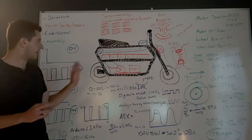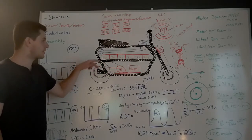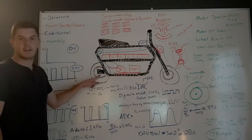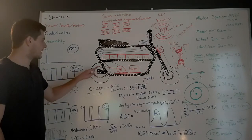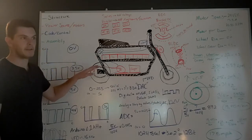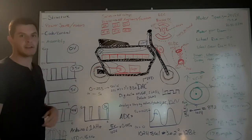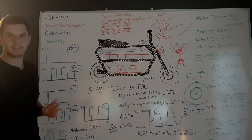The final thing we're going to briefly touch on is the axles. When you run the axles through your frame or through your metal tabs, you're going to want either some sort of bearing — really any kind of bearing would work if you can mount it properly — or some sort of friction-reducing sleeve that will prevent the axle from bouncing up and down in the hole, because when you're riding you don't want it to be bouncing all over the place.